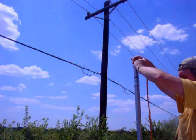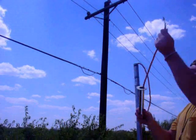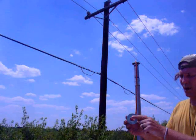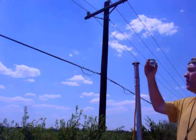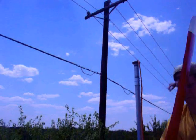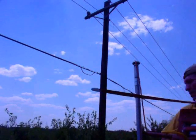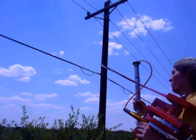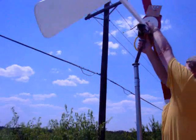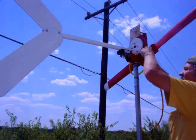Alright, I've got another piece down here. There we are. Looking at these washers — you notice one side the edge is sharp, the other side is smooth. I want to put that smooth side down — that's what it's going to ride on. I've got to get this wire up the middle here. You know, if my blades started to move, I've got these shorted out. It's a good idea while you're working on it to make sure that you do have it shorted out.